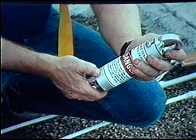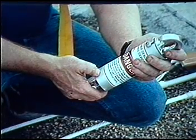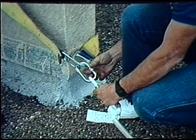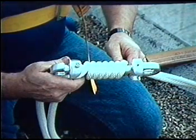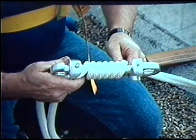To remove the cover, unscrew the thumb screw at the top, then push in the detent pin on the bottom. Insert the lines through the curved upper slots. Remember, each line should be attached to an anchor point that will withstand 5,000 pounds of dead weight. You'll need at least 6 total turns on the shaft. That's 3 turns of each line for descent of a 150-pound person.